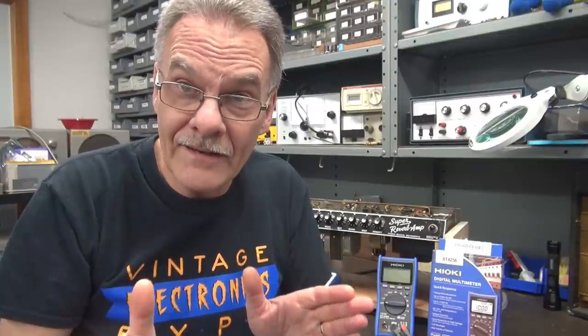Unfortunately, after he played it for a short period of time, the amp was overheating. And he figured that out and he shut it off, contacted me, and sent it up here for evaluation. Turns out it lost negative bias, so the output tubes overheated, and that's what he smelled. So it's a good thing he killed it when he did. I was able to repair that, put in the stock tubes, and the amp plays.